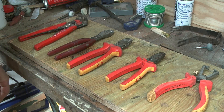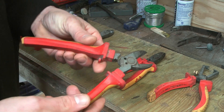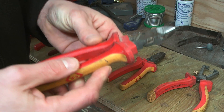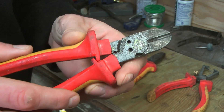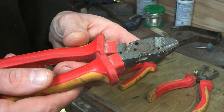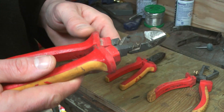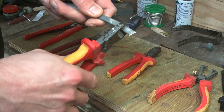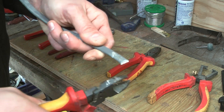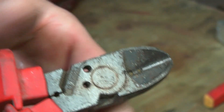And that brings me to my favourite — my CK side cutters. If you're on price work, second fixing houses on site, these magic little tools can transform the job. The Swiss Army knife of wire strippers, these simple-looking side cutters actually have four functions. Let me explain by using some twin and earth cable. Firstly, the pointy cutting tip allows you to get into some tight spaces — so cutting the outer sheath of the wire, that's function one. Function number two: here's where these side cutters show off their engineering genius.